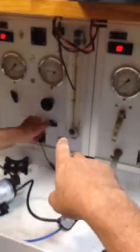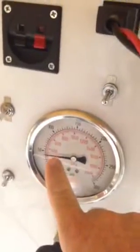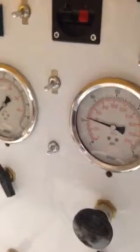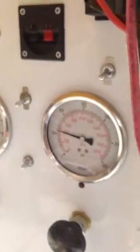We have the accumulator tank set. You can see some cycling, but with the accumulator tank, you can see. Let's see where this shuts off actually. Okay. We've allowed some backflow to show you how the pump will actually work in your system. When you activate it, it's going to run until, right now, it hits 60 psi and then it'll shut off. Alright, well, 60 is not where you want it. You want it at 80.